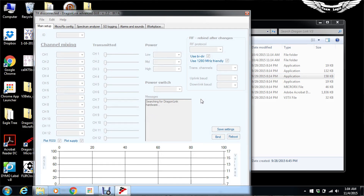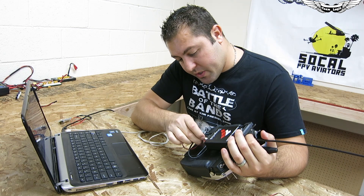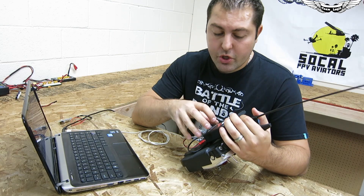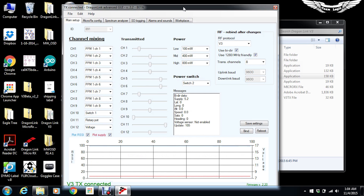With the GUI loaded it says 'nothing found,' flashing and waiting for the transmitter. Quick note: when you plug this into your computer it will provide enough power for the software to read the transmitter, but it will not transmit anything to servos without being connected to your transmitter. As you can see, there's a monitor showing the different servos and their movements as I move the sticks and flip the switches on the transmitter — pretty exciting to have all that information there.